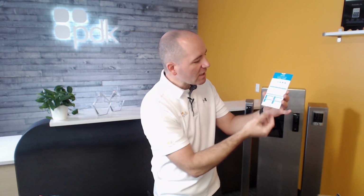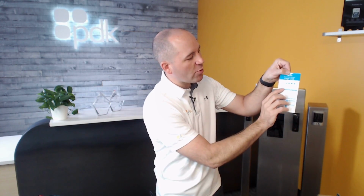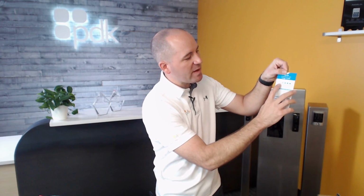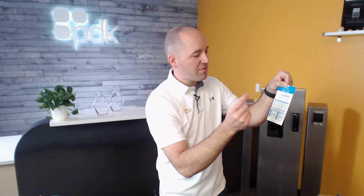So if I look at the back here, and you can't really see this, but just take my word for it, you can move this calculator up and down. So I'm starting here at 1 amp at 24 volts DC. It's telling me if I run 100 feet, I can utilize 22 gauge wire. If I'm running 800 feet, I need to use a minimum of 14 gauge wire, which you see on the slide. When we come back to the slide, you're going to see the difference in a 22 gauge and a 14 gauge wire, and the thickness of that wire.